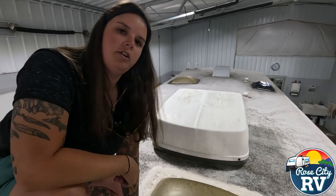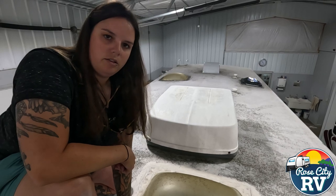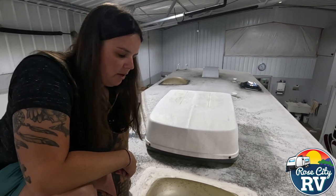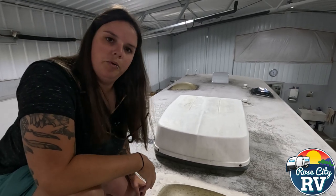Another thing is making sure you're putting on the right materials. If you go put silicone on this roof, it will not stick — you have to use the correct sealer. If you need that, we're here to help. If you just need some guidance on what to look for and what to use, this should help you with that.